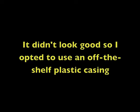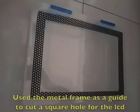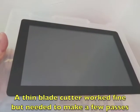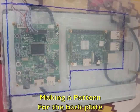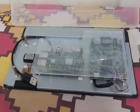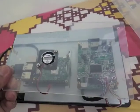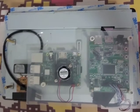Moving on — my initial setup was bad, so I thought about just using a normal plastic casing that you could buy from a regular office supplies store. I was hoping to power this up using my lithium-ion batteries, but it seems those LM2596 DC converters I bought from China had some problems. After I set the voltage down to 5 volts, it flickered up to about 10.4 volts for a split second.